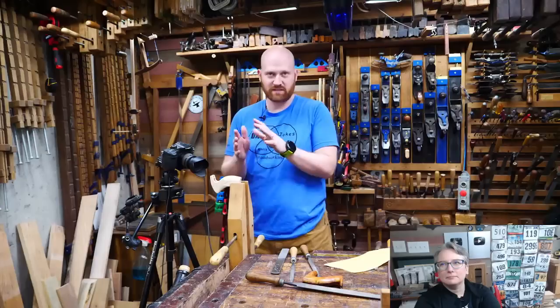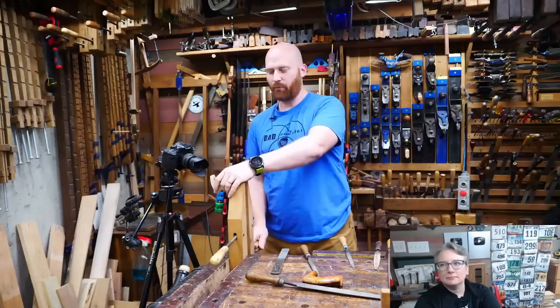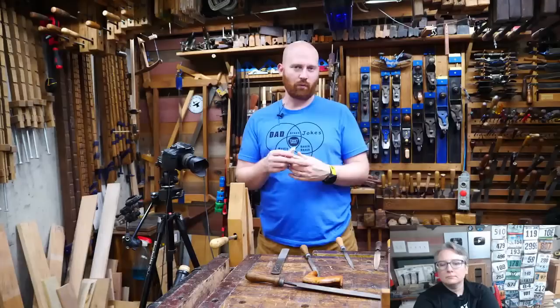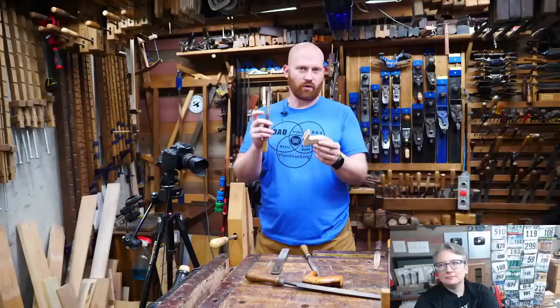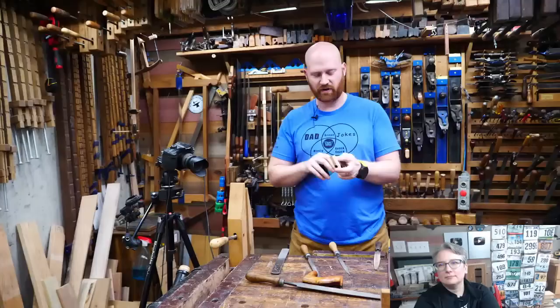What I end up doing is taking it piece by piece and doing each spot individually. I'll do all the spots until I get to the finest file, and leave the finest file until I do the whole thing. At that point I'm feeling it in my hand, seeing where the rough points are. Once everything's feeling right other than a few marks to get rid of, I'll go over with the fine file and really clean it up.